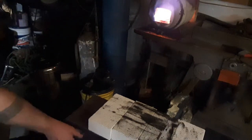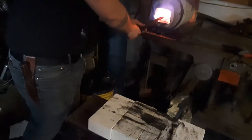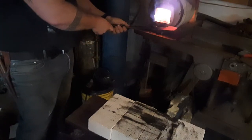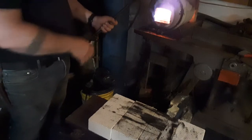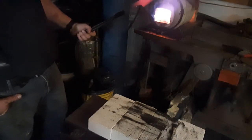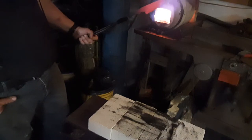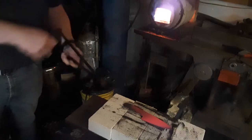Actually, this thing looks like it's already close to the temperature I'm looking for. Yeah, see — it's not magnetic. Still a little bit magnetic, but that's what we need to get the grain structure nice and fine. Get a real hard knife going on. I'm going to lay it here and let it cool to black again. I ran my mouth long enough to where it got hot.